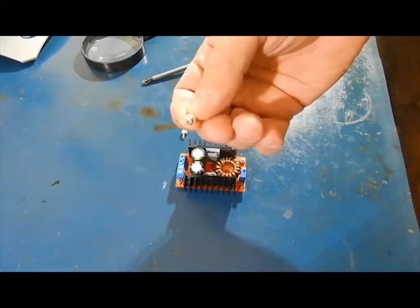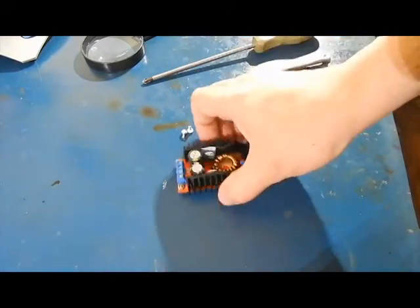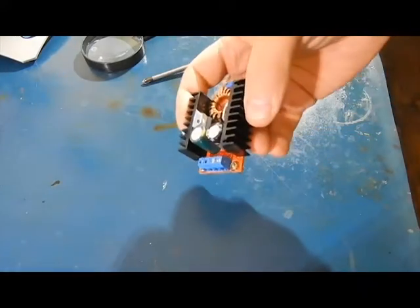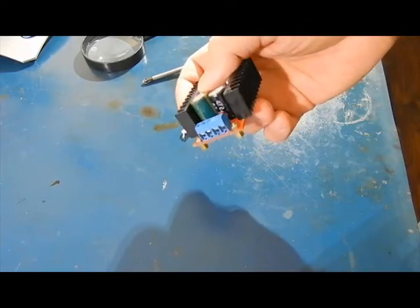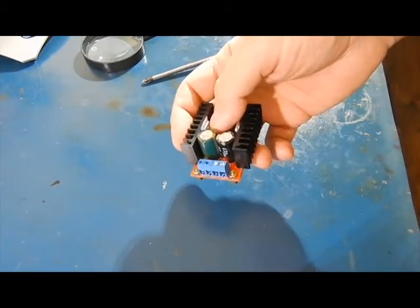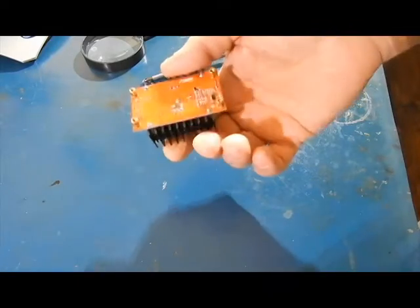You'd have to either replace that soft washer they got in there or really tighten them up. Because they were so loose they didn't give a little snap when you turn them — they showed that they were tight but they were just super loose. So that's one of the reasons why this failed. It wouldn't matter if I had put five fans on top of it without the heat transferring to the heat sink properly — the IC is going to die.